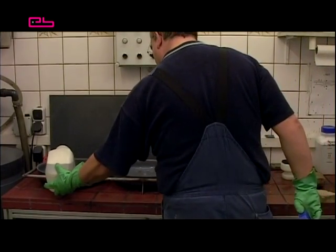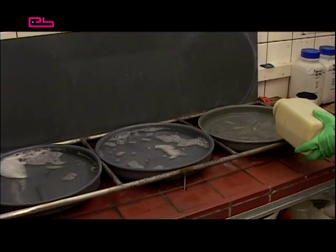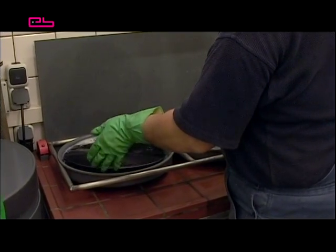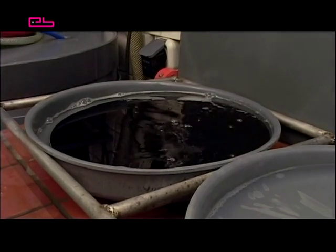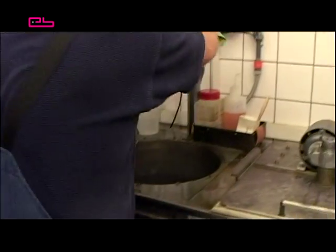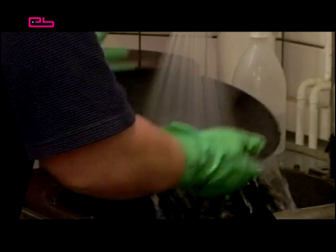The next step is necessary to enable the formation of a cohesive aquatic monolayer on the foil. The foil is then wetted in three different baths and so prepared for silvering. The timing is very important here. If the foil is left in the preparatory solutions for too long, the background noise of the vinyl might increase. If it's taken out too early, however, the record might crackle.